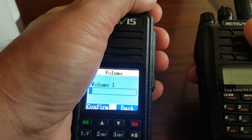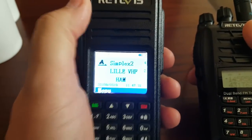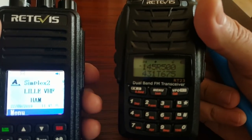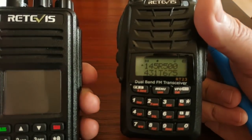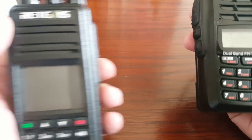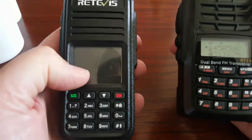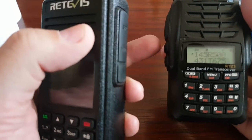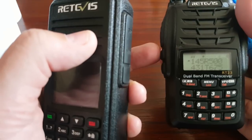I barely received the little repeater here upstairs. So anyway, this one will transmit on VHF, this one will receive on VHF and retransmit on UHF — so basically this will be my transmitter to the repeater. And with this radio, I will transmit on VHF but also receive the repeater directly on VHF without going through the RT23. I hope this makes sense — let's do it. And it's raining, of course.